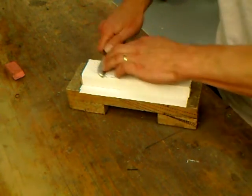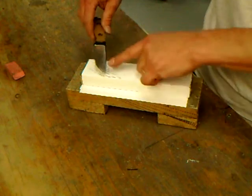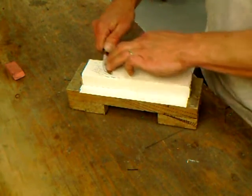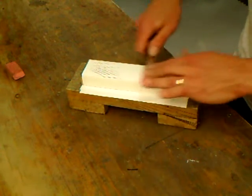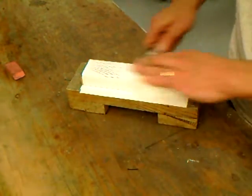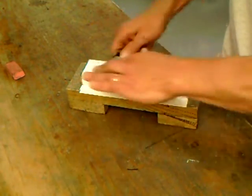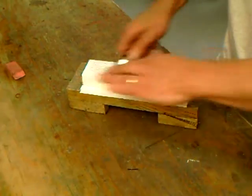But if I want to remove some metal and grind over the top of those 600-grit sandpaper grind scratches, then I've got to use a little more pressure. Now as I drop it back down on the flat — the convex closest to what is the shoulder, the spine — I can actually go back and forth. I'm not going to cut that paper, but I'm very close. This is a very acute edge on this thing. Normally I'll do one pass with fairly heavy pressure, because I want to get some grinding action out of that compound.